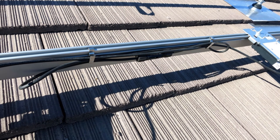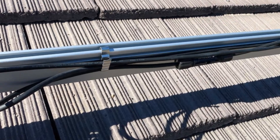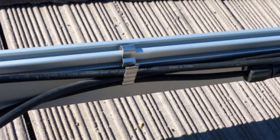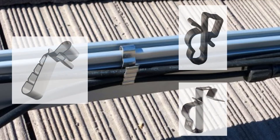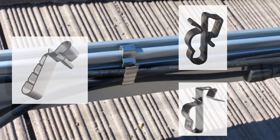And here's yet another alternative to wire ties — hanger clips. The particular ones installed here are Wiley ACC R4 long cable clips that can hold multiple wires quite easily. The top part of the clip snaps in nicely to the top groove of the rail and then you just hang multiple wires inside of the hanger. There are many different designs of hanger clips, typically differing based on how they clip into the rail, so you want to get one that's specifically okay to snap into your rail.